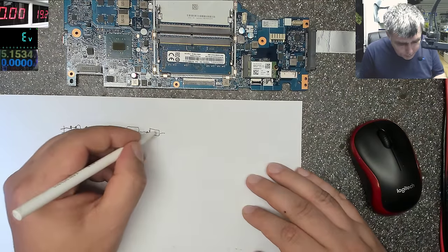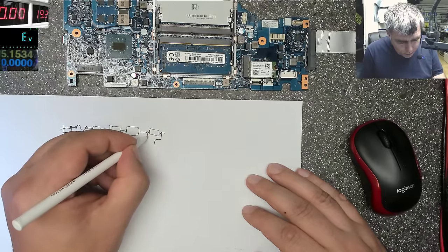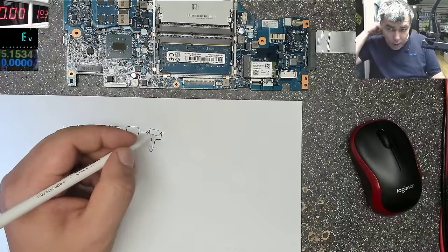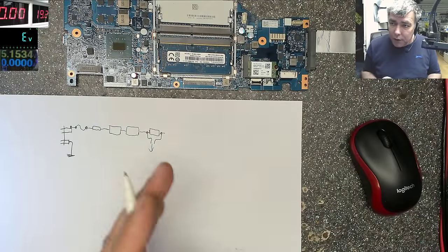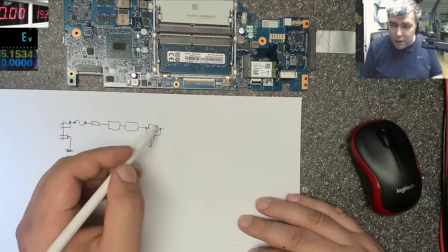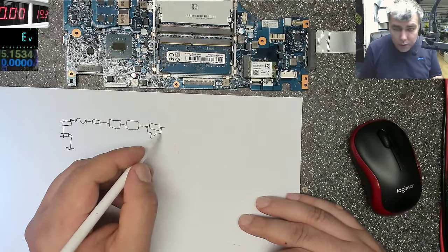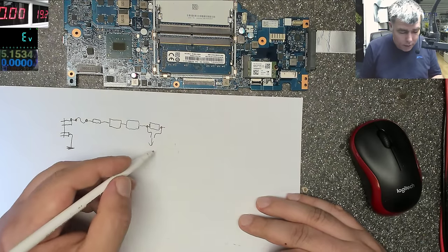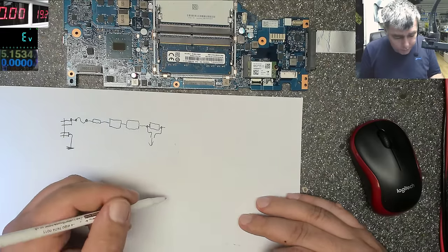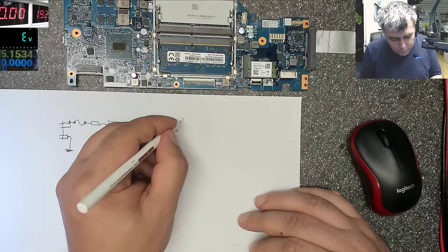This is the current sensor, which is a low ohms resistor, and from here, you remember, we've seen these two pins going to some power management chip. The current sensor always checks the current. If something goes wrong here and you have a short, the current goes up, yeah? The voltage on these two points will rise, and the power management will probably cut the power to these two MOSFETs, okay? And this is my main 19 volts power rail.